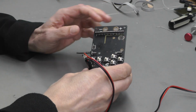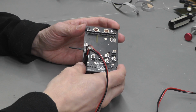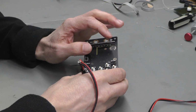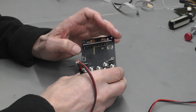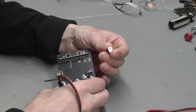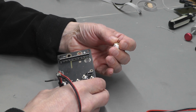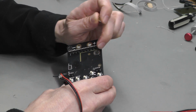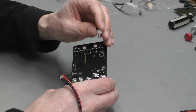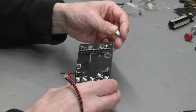So with the PDV-S2 Mini now programmed with its firmware, the next thing to do is fit a test LM399 and my test LCD to it. I don't solder in the LM399. I've actually got one here that I changed the pins on, so they're slightly thicker pins, and it's a nice interference fit on the holes in the PCB for the LM399, so it gets a good contact, so I can fit it and then remove it again and move on to the next board.